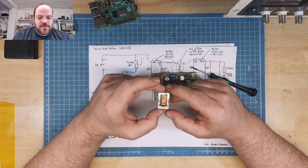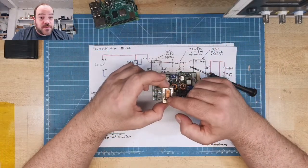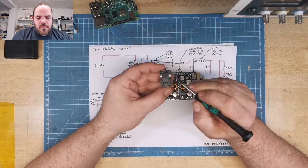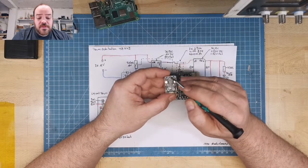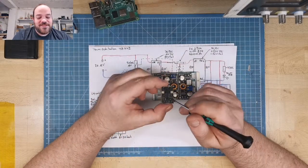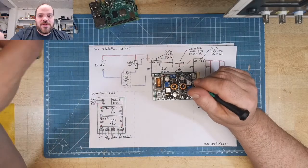I found four or five of them on a board from an old industrial machine. So I use this. It has two contacts, on and off. But the weird thing is, one side is normally on, this and this contact, and the other side is this and this contact. So it's crossed, and this drove me crazy. I thought this is not working, and I got another one out, and it was working. It was just me not looking carefully.